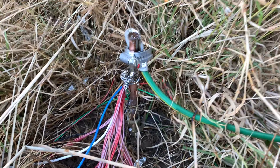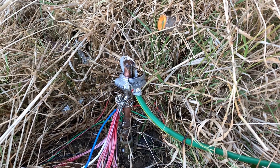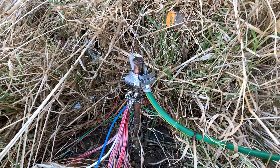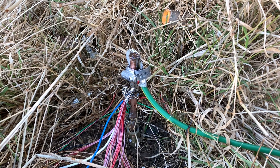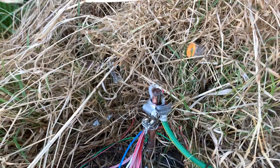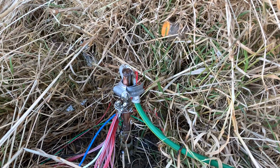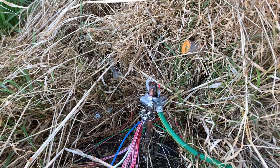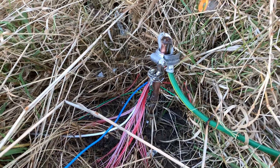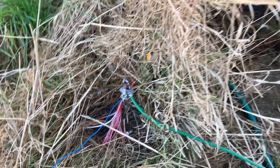I've just worked a station in Newcastle, Pondline, 5-9 plus, which isn't too bad in the middle of the day on 80 meters, particularly as propagation on 80 for a while now has been absolutely terrible. I also added an additional radial, so there's one more radial now — adding radials certainly won't do any harm. I'm just going to go inside and check the auto-match on the rig. So that's my new upgraded RF earth.